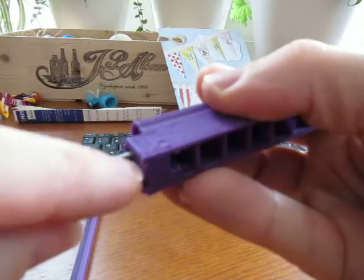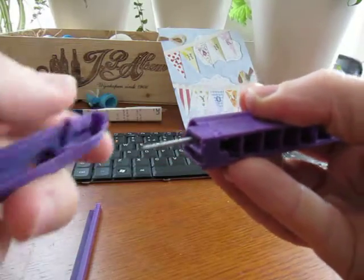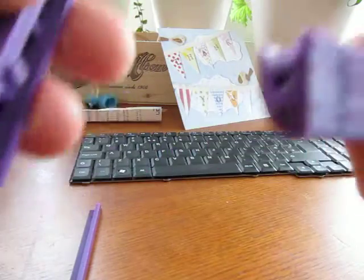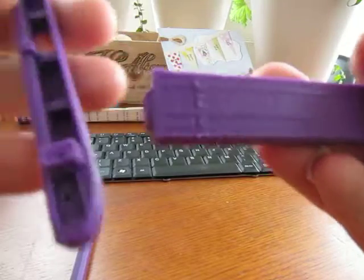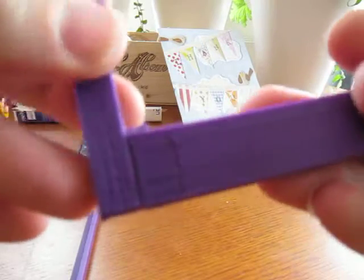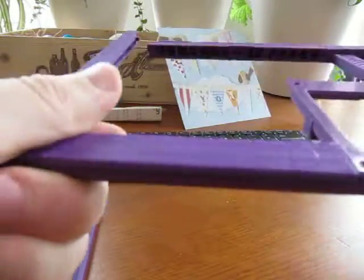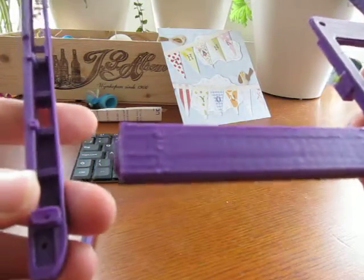Basically there's interlock into this piece and interlock into that piece, so they both interlock with each other. The same principle applies here — one part interlocks into that groove and this part interlocks into there, and again it doesn't move. So there's no creaking if somebody picks the laptop at the corner and stresses the whole thing, because the plastic just won't move about.